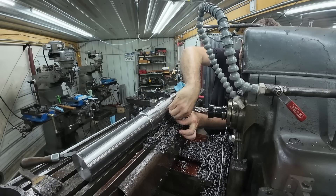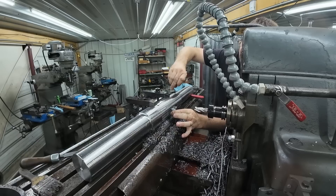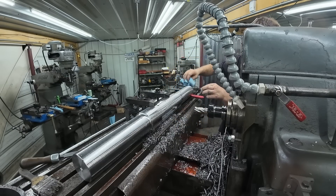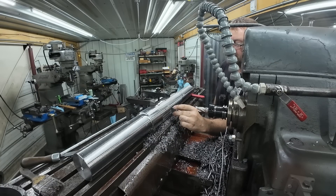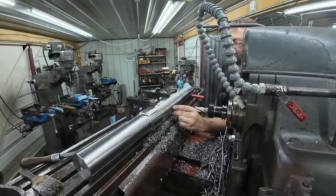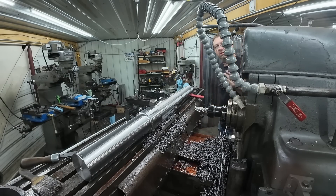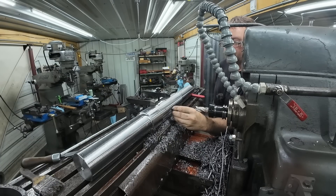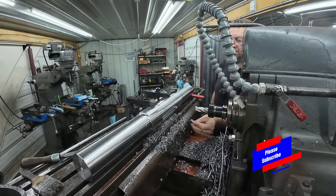Here we have our 750 and our 125. Oh, that just fit. I have a plus-one on the size, minus zero. I'm going to grab the 126 — here's our 876. I measured it with a micrometer. It won't quite go... oh, there it went. Still within tolerance. Now the 877 — the next size up. I can't even get it in there. Perfect. That's just what we wanted.